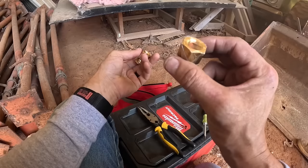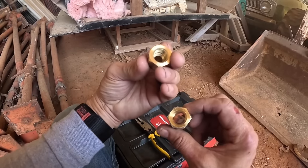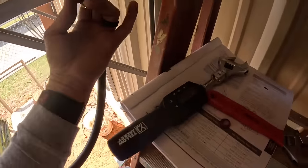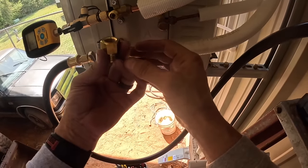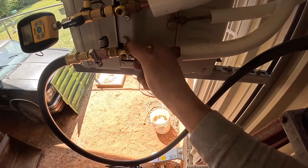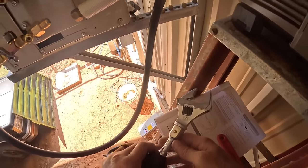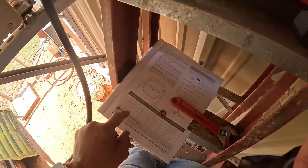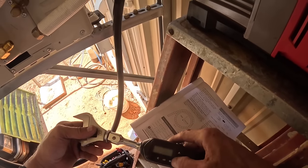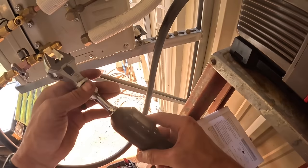All right, this is how they sent the adapter. It comes with that coated copper piece. Because that one's got a little bit of trash on it, let's use this one. Put it on the cone of metal. Put it on the metal part, maybe. I got it. You can tell if it's hitting, since it's metal, it wouldn't just screw on there easy. All right, that is a 3/8 fitting. 3/8 max. 26 Newton meters. Mm-hmm. That's where I've got it set.